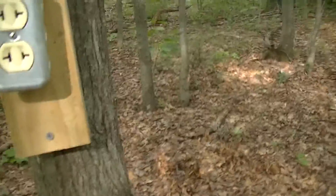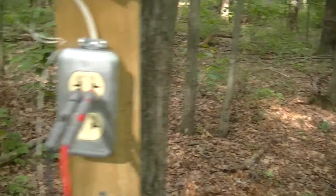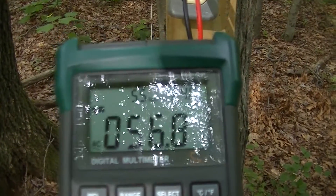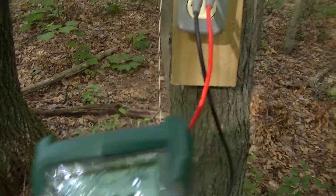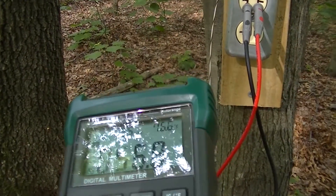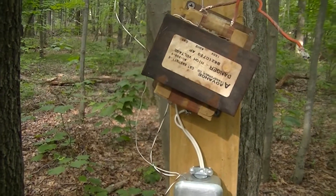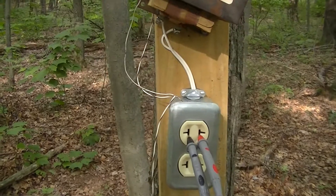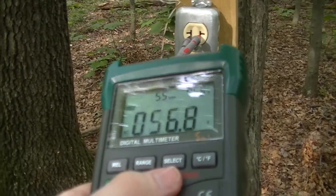The way I'm doing that is by using a big potential-halving auto-transformer that I think is from the 1930s or 1940s — it's very old. It was originally designed for dropping 230 volts down to 115, or 220 down to 110. So I'm just using it to step 120 volts down to 60 volts. Instead of the 90 watts and 200 volt-amperes the system was using before, now all three transformers combined are only about 27 watts and 50-odd volt-amperes, which is much better.